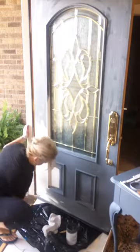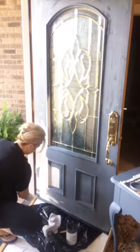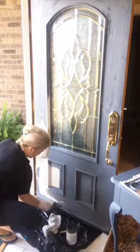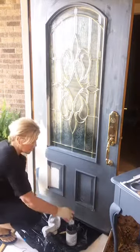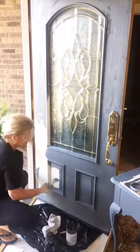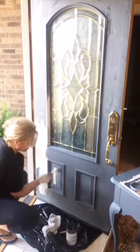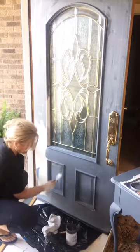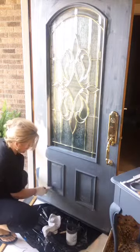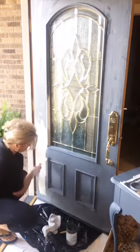Paula, I cannot pronounce this name, and hopefully they'll forgive me. I'm not even going to try to butcher it, but they're wanting to know about the brush marks. I think what they're seeing is the first coat. Don't worry about the first coat. You're going to get this with any paint. You're going to get this with this paint. But once this coat is on, this scratch coat as I call it, the second coat, and I think people that have used the paint product can attest, the second coat for this paint product is amazing. What it's going to do in self-leveling is absolutely gorgeous.